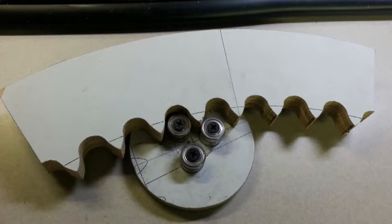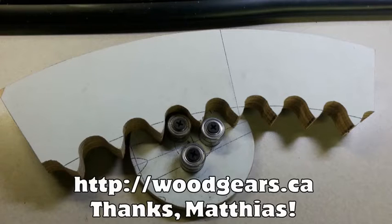The muller's gear reduction began here. This is one of seven sectors of three quarter inch plywood curved racks and a three tooth lantern gear that engages it. I used Matthias Wandel's gear generator program to make these. There are 52 teeth in the big gear, which gives a 17 and one third gear ratio.